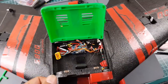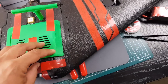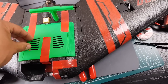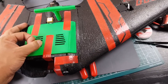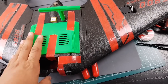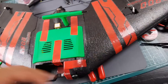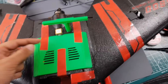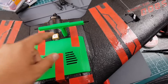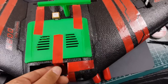I'm also going to be doing receiver testing. We have a GPS which will tell us how far we've traveled, along with RSSI data. I'll be setting up a small 20 by 20 flight controller stack with a DVR and another receiver. I'm using R9M and Crossfire, both running 900 megahertz, so I won't be affected by anything on board. The idea is to see the RSSI reading throughout the flight while also logging GPS data — I think that's going to be pretty interesting.